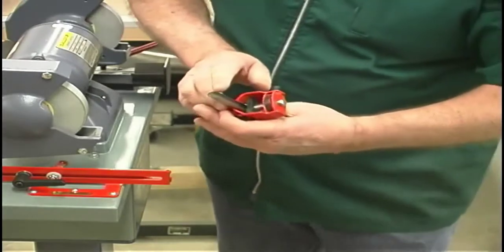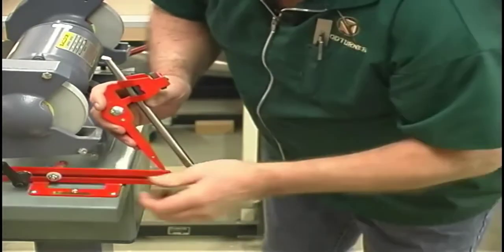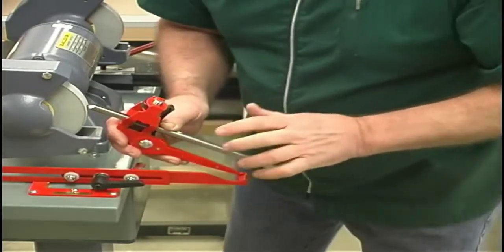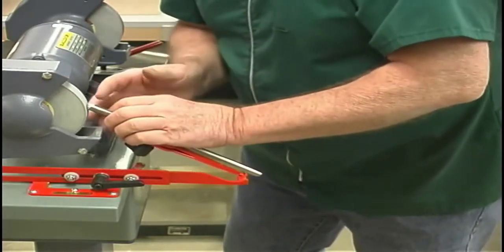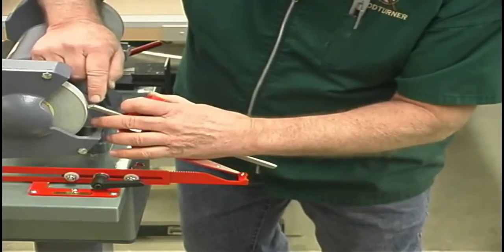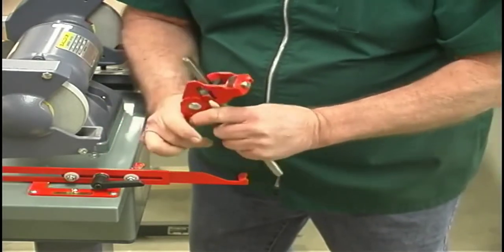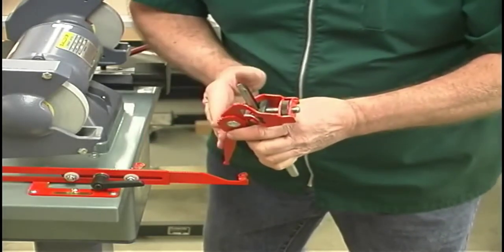If I want to maintain the cutting edge that I have here, I have to bring back my slide until I match the end of that tool. Nobody says I cannot check this with the grinder stopped. When I check this particular grind with the grinder stopped, I'm not even coming close to the end of the tool here on the wing. That tells me that to pull the wings back further, I have to spread my arm forward. I was back almost parallel with the tool.